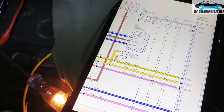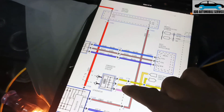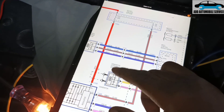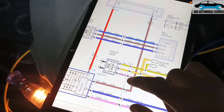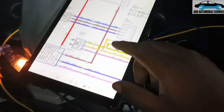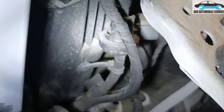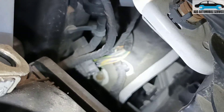You can see that this connector shares the same thing with a battery sensor — sorry, generator current sensor — which monitors the current that the alternator is sending to the control unit or fuse box. They share the same socket, so I was looking for that socket to find where the short is. I took the battery positive out and the light goes off, confirming it's a positive feed. When I check the diagram, you can see the second battery sensor for the fuse box.